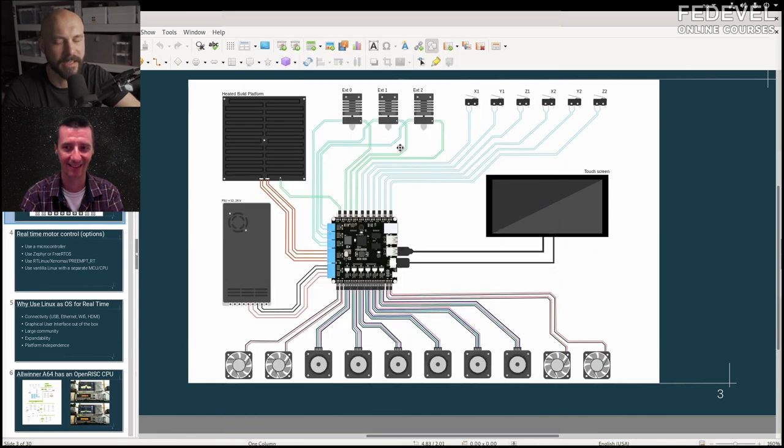In the extruders, how accurate are these temperatures? Filament specs say things like 'use 235 degrees,' so it seems like it needs to be very accurate. Most printers will differ quite a bit from the absolute temperature, but you can tune it to your specific needs — adjust up or down five degrees or so. It's also pretty forgiving because there are a lot of other factors that matter.